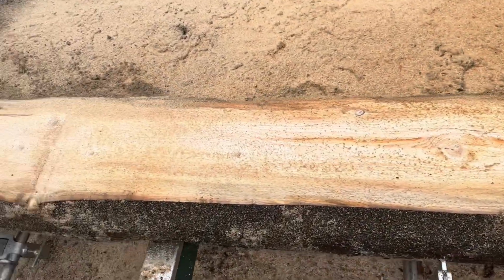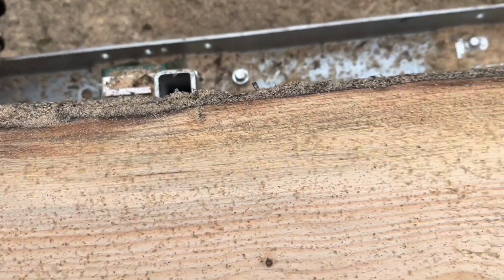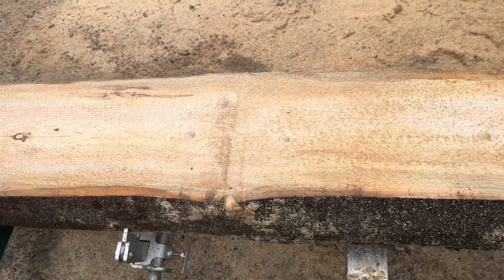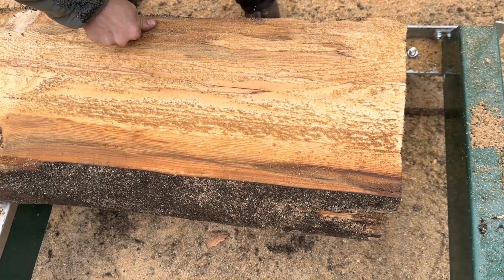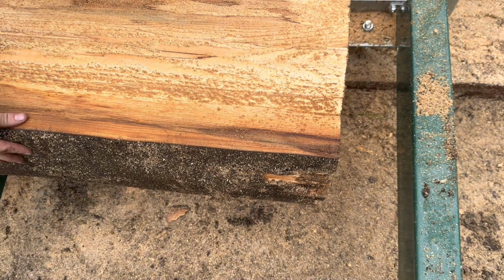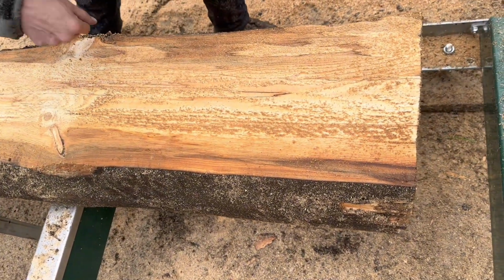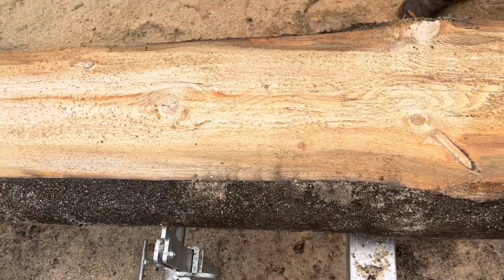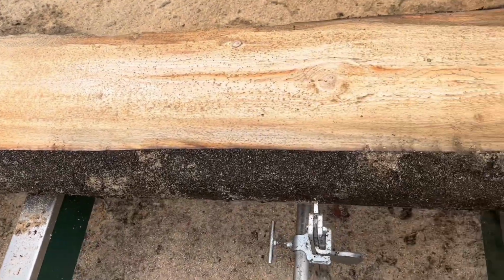The equation is starting to change now. See that good wood there? A lot of good board feet on that. Some bad spots, not everything's going to be good, but it gets better as we cut it. We're going to have to cut that top cant off of there anyway. You see the water is saturated, but it ain't caving like that. Even if we just buzz that off and compost that, and use the rest of this, we still got 8-foot boards.